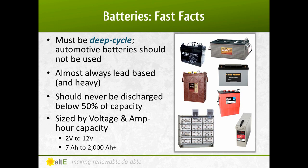PV systems can have many batteries, each of which can weigh 50 pounds, 100 pounds, or much more. Additionally, there are losses inherent in batteries as they convert electrical energy to chemical and then back to electrical — 5–15% of energy can be lost to storage and extraction. You should never use more than 50% of the rated capacity or you will quickly reduce the battery's ability to hold a charge and have to replace the bank. These losses need to be taken into account when calculating the size of a battery bank.